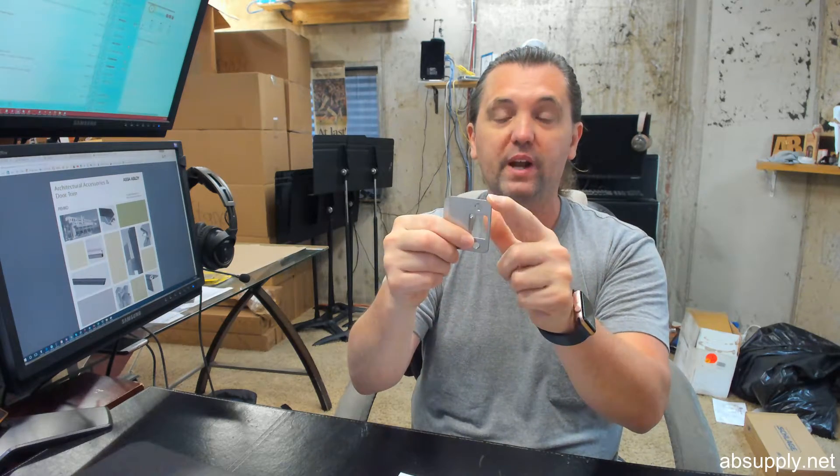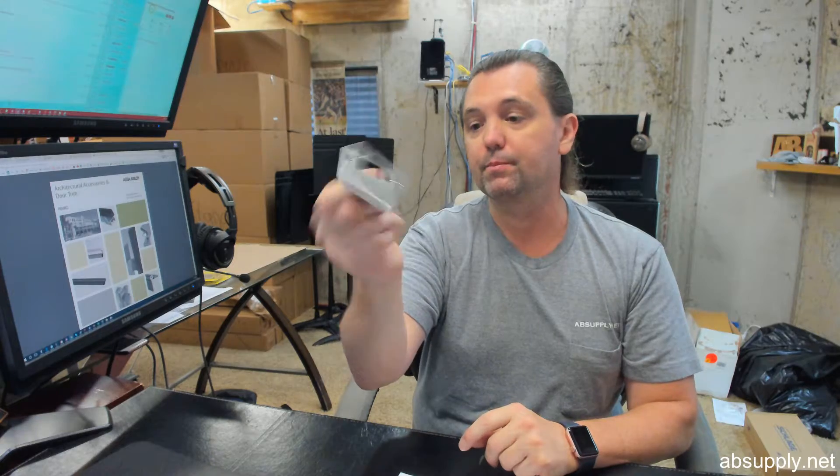If you're going to powder coat something, you'll powder coat the least expensive base material. That DU finish will be complementary with oil-rubbed bronze type hardware. There is also a second link below this video to a document called product catalog that will allow you to review all of the extended lip strikes from Donjo and other strikes — if it's a strike, it's in that catalog. Finally, there's a link to the manufacturer's page where you can pull up all the Donjo products we sell, a link to the manufacturer's website, and a link to the full product catalog.